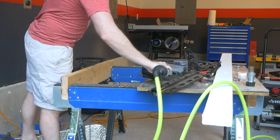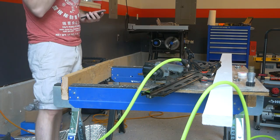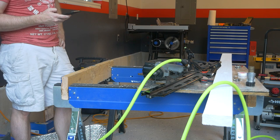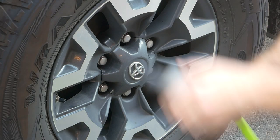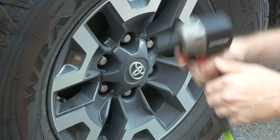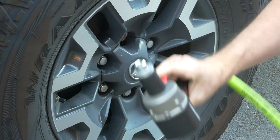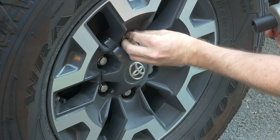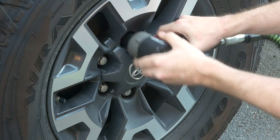I ended up getting 14 shots before a recharge that took about 50 seconds. So maybe not for full time use, but intermittently, not a problem. Running an impact wrench is also within the Husky owner's capability. My little stubby Earthquake from Harbor Freight can pull the lugs off my Tacoma and barely slow down. Just keep in mind, you might not have the same luck if you're running the wrench off some small quarter inch air hose.